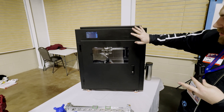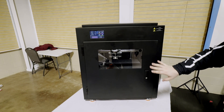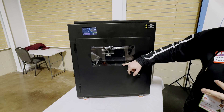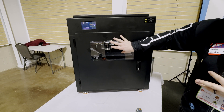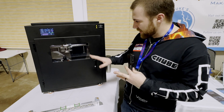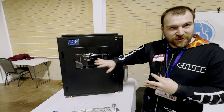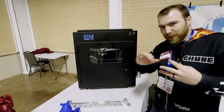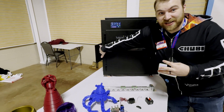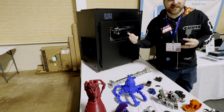The other really big item here is the Lab Magi. The cool things about this model are that it is an actively heated chamber — you can get to 80 degrees Celsius in the chamber and 115 degrees Celsius on the bed. It uses the Calamity tool head, so it's all metal, easy to service, never have to worry about it melting. It does have a beacon probe so you get perfect level prints every time.